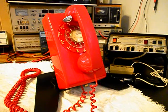Now, this unit has the port plug at the back of the telephone to accept a wall jack, and that does work. But we want to give a second option because Deborah's not sure exactly how they're going to connect this telephone to the line. So we want to install a modular port inside this telephone so that you can simply bring in any length line cord, any color that you choose, plug right into the modular port, makes for a simple, easy plug and play connection. So we'll be going through the entire telephone while it's in the shop.